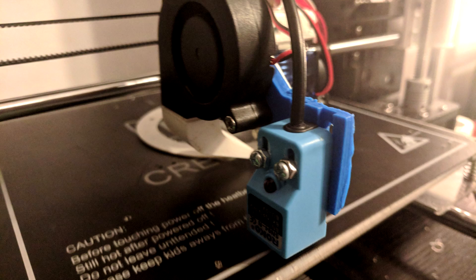Compared to how it used to be, it's definitely a lot better. In conclusion, I think it's a very good update — removing weight from the print head really helps with print quality. I like the usability of this head: you don't have to keep taking the fan off and recalibrating, because the Z sensor is connected to the fan and you don't have to continuously reattach it to the cartridge. I do still have to readjust the bed leveling sensor occasionally. I'm hoping the original E3D will be even smoother in that regard, which is what I'm looking forward to when I buy it.